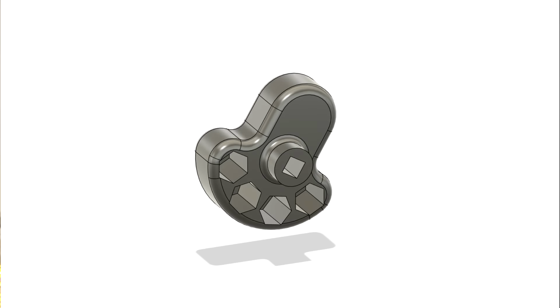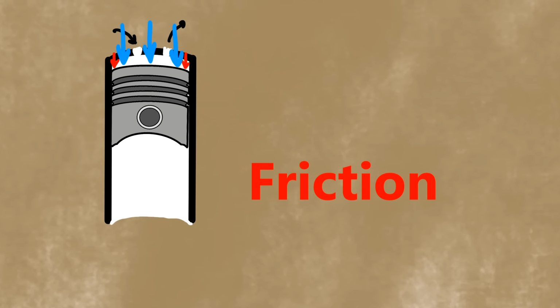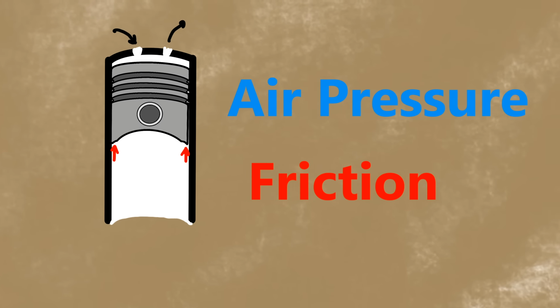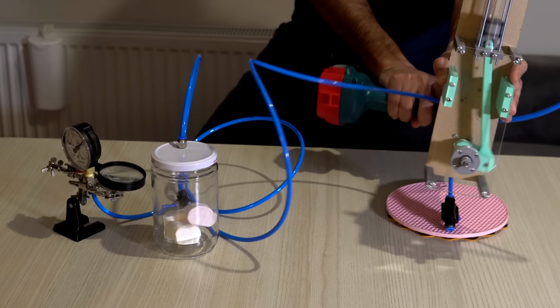Let's talk about the second type then, the kickback. They are more important in our case since the compressor isn't spinning that fast. When the piston is compressing the air, it's both fighting friction forces and pressure forces. But in the intake stroke, it's only fighting friction forces. So when we plot out the torque requirement of the piston over time or over crank angle, we get a waveform. And when I'm spinning the compressor with a drill, I'm finding this constant change.